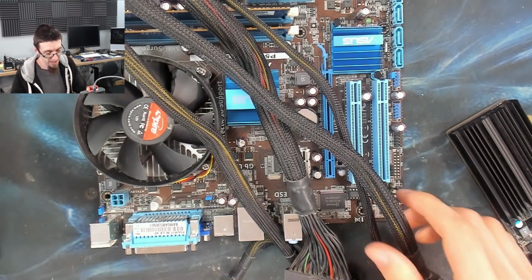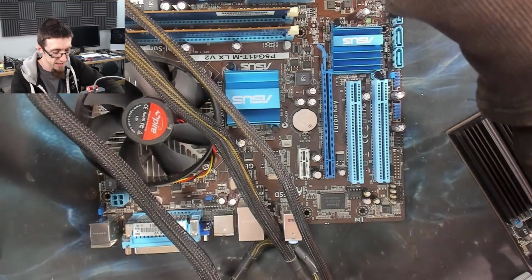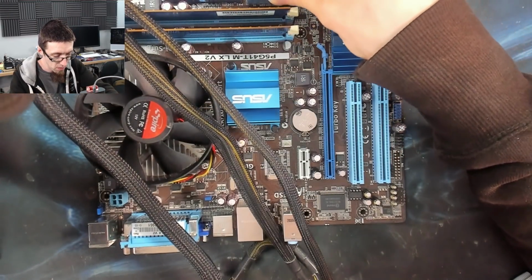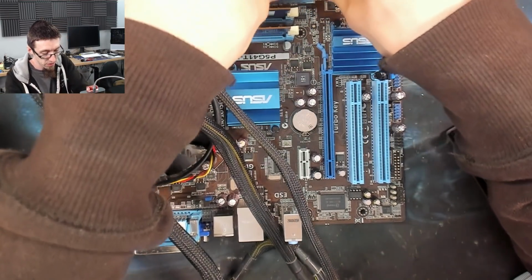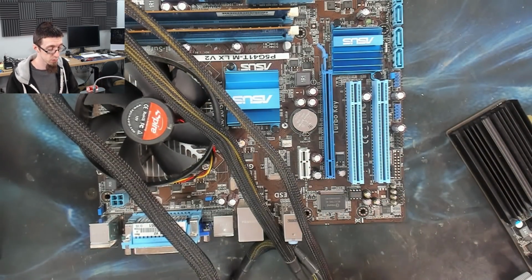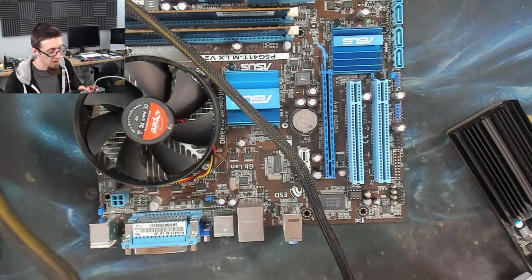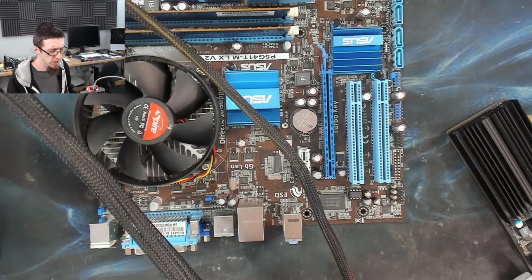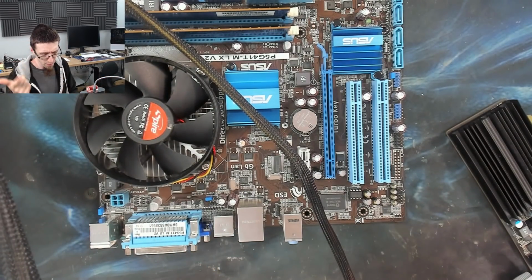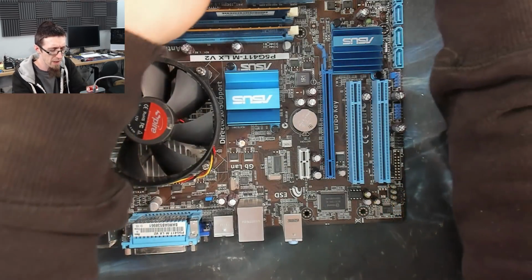And what I mean by that is, as I mentioned, because modern motherboards are going to be using all solid-state caps, the only kind of boards where you're probably going to see bulging caps like this are old motherboards, like this one. And they're not worth doing. You could do this as a hobby project or a passion project. I'll tell you more about that in a sec. But this isn't an economic repair from a repair business standpoint.